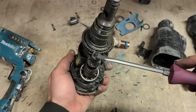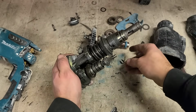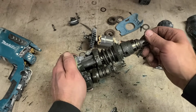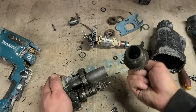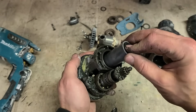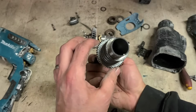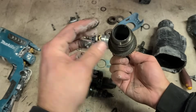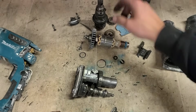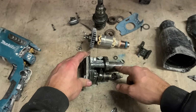Take this apart. Big push on clip up here. Pop that off, and the washer. They're holding on this gear assembly, but they also just stop this clutch gear from getting past. Pull them off. That can come out. And there's the problem. Bone dry. And the actual hammer, or the striker, is jammed inside the piston. The striker bolt's still moving on the inside, so that should be okay. Main thing is just the piston, the striker and the O-ring.